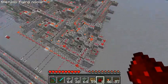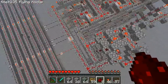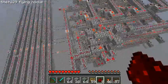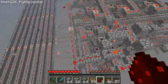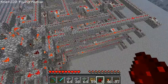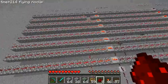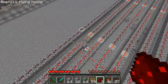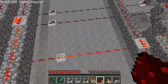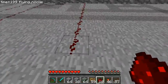I've connected the buses to the adder. The four inputs on one side are connected to the second bus, and the four inputs on the other side are connected to the first bus. The output of the adder is here — at the moment it's got 15 and 15 being added together, which overflows to create 14. This line checks to see if the opcode indicates addition, which is 1, 0. At the moment it's 0, 1, so it's red. If I turn it off, it'll go dark if the opcode is 0, 1.